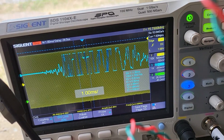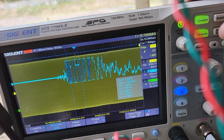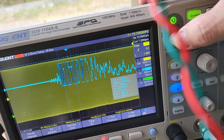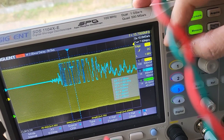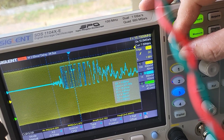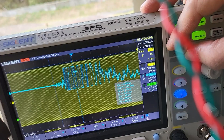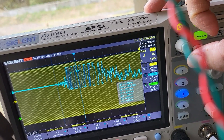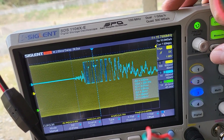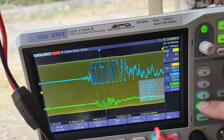The blue trace here is the vertical accelerometer output. You can see that there's a lot of vibration going on even before the bullet exits the barrel. Comparing that spike — the yellow spike from the coil output — you can see there's a lot of vibration from the vertical accelerometer, which indicates that the barrel was whiplashing quite a bit. I set the scope scale too low so it was clipping. We'll redo those measurements later.